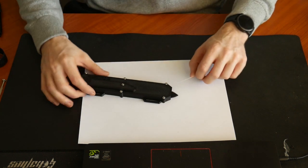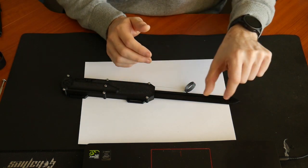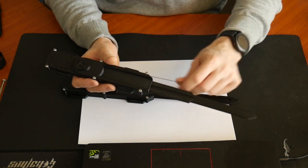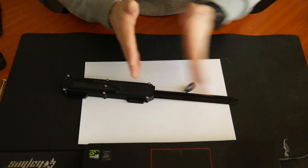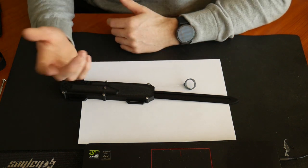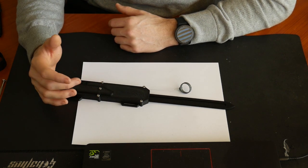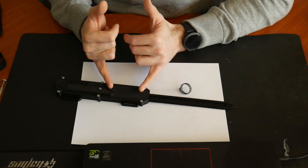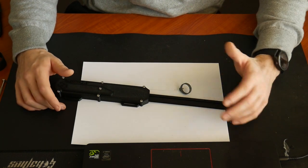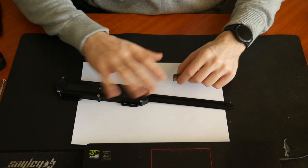I'll just show you it working. You can see it is a little bit louder in terms of the period of extension and retraction compared to the OTF one. The OTF is only loud when it fully extends and fully retracts, but this one is loud as it's coming in and out - obviously because of the gears. A subscriber suggested a bearing system, which I really like - we can put some bearings in the middle of all the gears and that should smooth out the mechanical action. The plastic material is what's making it loud due to rattle between the gears. If this was made of metal it would automatically be a lot quieter, and with bearings added it would be very silent.